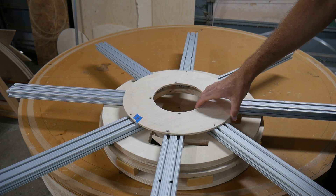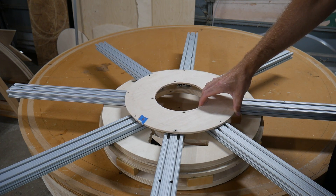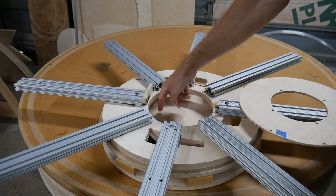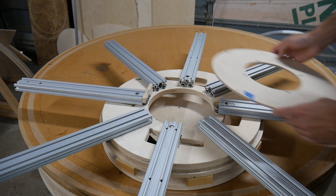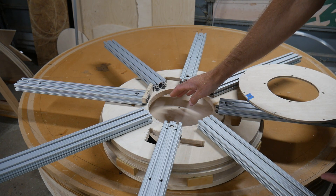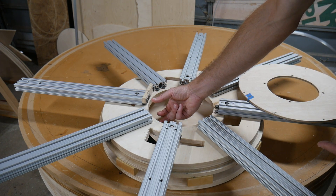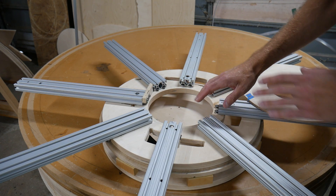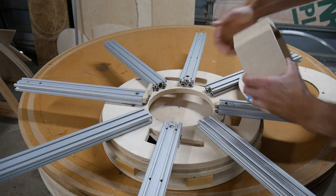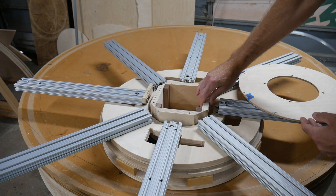Supporting this drive plate is a great example of thinking about something in CAD and having a plan and then immediately throwing it out when you have to try it in reality. This needs to be fixed while these can rotate underneath. The original plan was just to build up a series of wooden rings and then support this on top, but the problem is you have to cut out a lot of rings and stack them accurately, or make a big block and carve it down — which is difficult because of how tall this is and you can't get router bits that long. It's much easier to just build something like this, where you can rip it to width to get your height on the table saw, then use the chop saw to put angles on the end and set it in place.